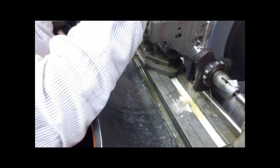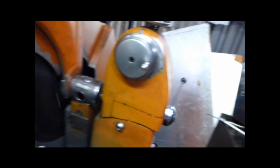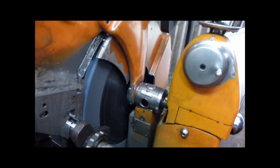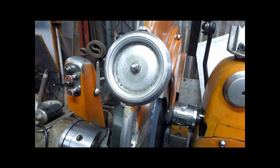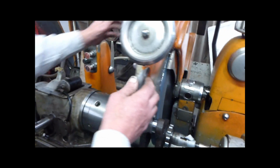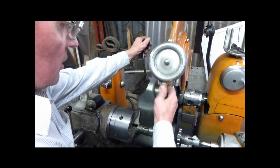That's it. See now, when I let it away, if I pulled it, that'll put a flat on. I know. But I'm one turn clear on here, see? That's why before you do anything, you back it off one turn. That's your safety. And that takes the wheel away that amount, that one complete turn. But then, if I hold it there, I just push this up and let it go away itself. All right, yeah. And then it goes back the other way.